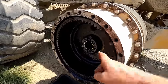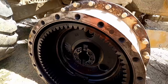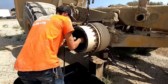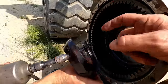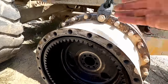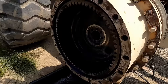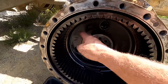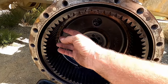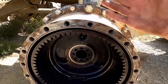We've got to pull these 12-point bolts out — there are eight of them. Once we pull this retainer off, this hub's going to want to come off, so we'll pull all but one bolt, get the crane on here to hold it, and then remove the whole hub. He's removed the retainer and you'll see there's a stack of shims in there — that's how we set the clearance on the wheel bearings. These have a tapered roller bearing in them. As we slide this off, we're going to get a gush of oil — that's the cooling oil for the brakes. This hub is going to slide off with the bull gear. We'll just leave it all together and pull it in one piece.